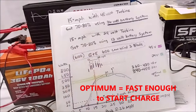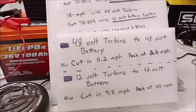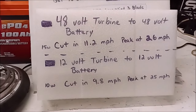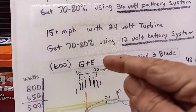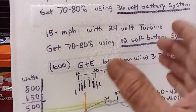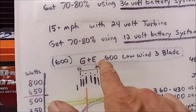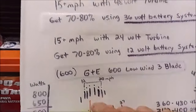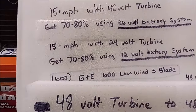With a 48-volt system the optimum wind speed is roughly about 11 to 12 miles per hour. This is the industry data: a 48-volt wind turbine for a 48-volt battery will cut in - meaning exceed 48 volts - at 11.2 miles per hour average. We're going to be using the 600-watt Green Energy Solutions turbine, low wind, three-blade. You don't need 12 blades, 13 blades, or 6 blades - three blades is all you need no matter where you're at, and they're quiet, very quiet.